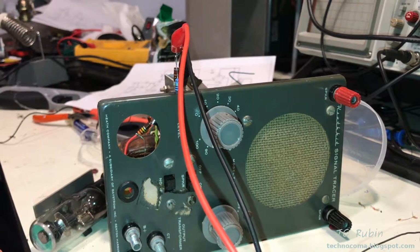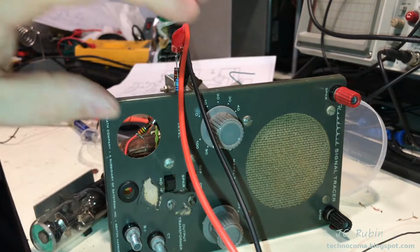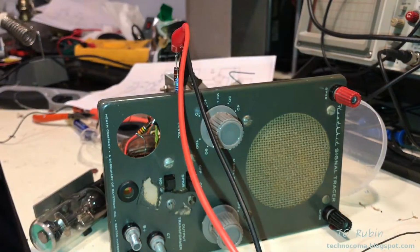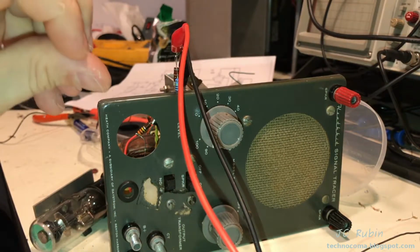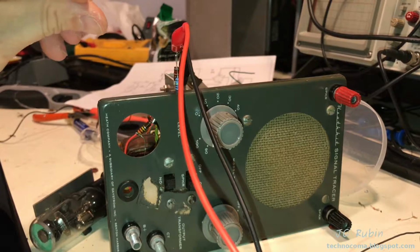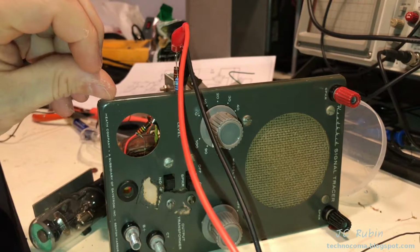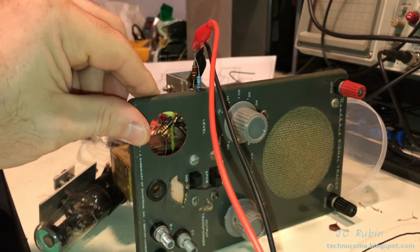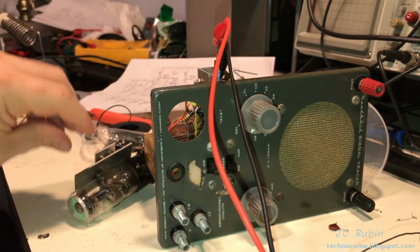First observation I'm going to point out is that I wired the volume backwards. As you could tell, it's sitting here upwards of 90. That said, in this direction, there's no complete cutoff, and you can hear a little bit of that 800 hertz coming through. So this is not a problem. It's just something I'm going to redress as an issue.